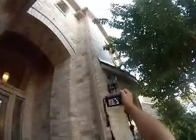This is the exterior inspection. Got a light here, and you can see the light clearly doesn't have any caulking around the base of it. The problem with that is water can get down the back, get in touch with the contactors or conductors, and then the whole wall could become energized.